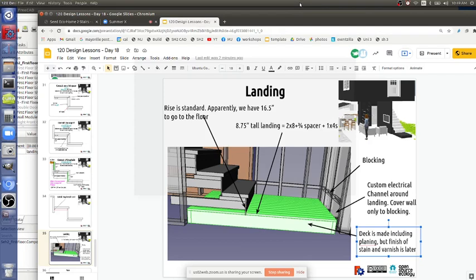We should preserve the house wrap - roll it up, fold and then roll. You rip it off - it kind of breaks off relatively cleanly so we should be able to get them out; sometimes the staples just come right out too. Before we take off the upper decking or the roof we should take off the house wrap first. We need somebody on top and maybe somebody on the ladder - have a person start at each of the corners toward the center and pull it off and fold it on the roof, then drop it. The carport might be nice to leave up until the second-floor wall module moves down because it offers a bit more space.